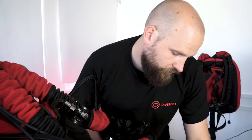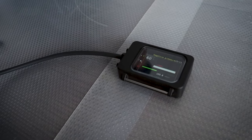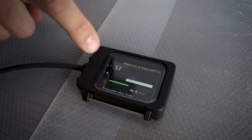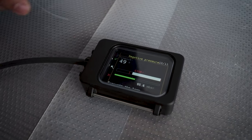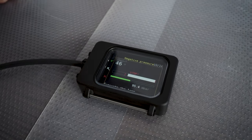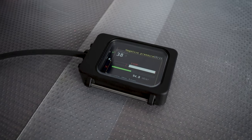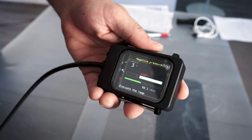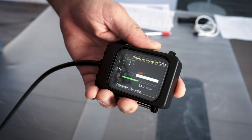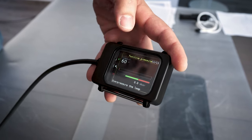I'm evacuating the loop until it says stop. I've now closed the loop and the counter has started. I've put down the loop hoses and the pressure changed a little bit. Once it's stabilized we watch the pressure drop. We're getting towards the end of the countdown and our pressure has barely dropped — about 2 millibar. The unit seals very well. We tick okay and move on to the next step, which is the positive pressure test.